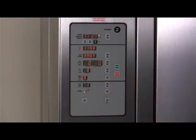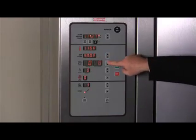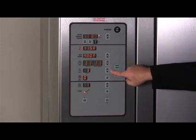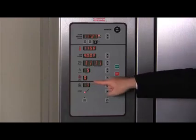To enter the desired temperature, press the temp up or down arrows. Now, set the bake time, steam, airflow delay, and vent settings. Press up or down arrows next to the bake timer to enter the desired baking time. Press the up or down arrows next to the steam timer to enter the desired steaming time. If steam is not needed, enter 0.